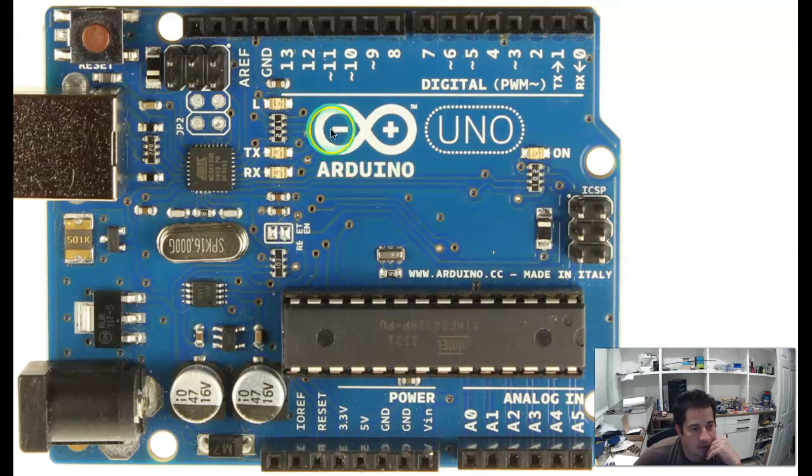And just a couple of notes about what's going on here. There's a lot of different things you could see on this board. This right here is the brains of it, the microcontroller. This is an Atmega 328P. One of the primary uses it has is in devices like this, where we're using it with the Arduino programmer. But you might find something like this, or at least a different package, with different pin arrangements and layouts, in some type of commercial product.